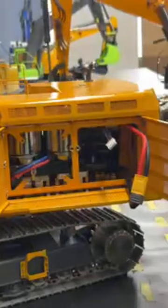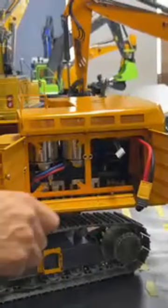This is all 35 kg servo. We want the moving of the arm and bucket to be more smooth. Most importantly, also the valve. The valve should be opened and closed precisely. The servo should have high enough torque and the position needs to be accurate, so the valve opens and closes precisely.